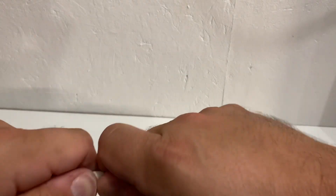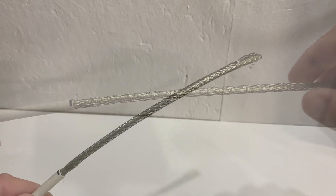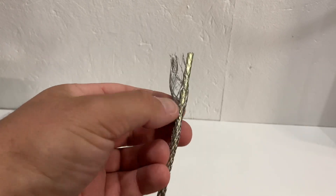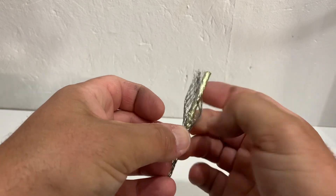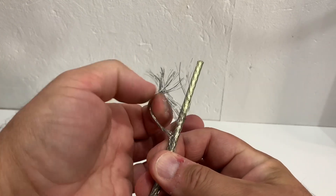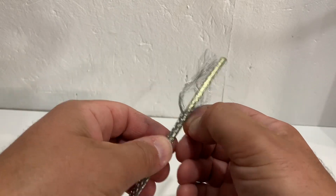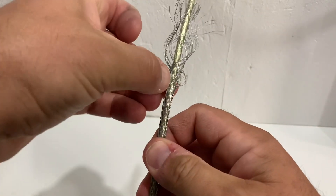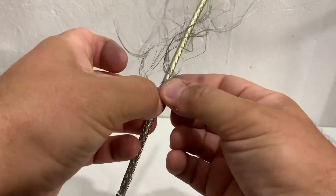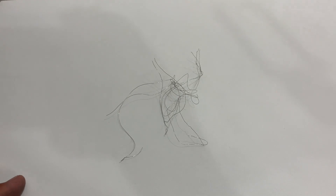Pull that jacket away a little bit and it should pull right off. Now, very carefully pull away the braided shielding from the cable. Just take your time doing this — try to unfurl it and work your way down slowly, pulling those weaves apart without breaking the fine wires, because you're going to need these to become one of the dipoles on your antenna.